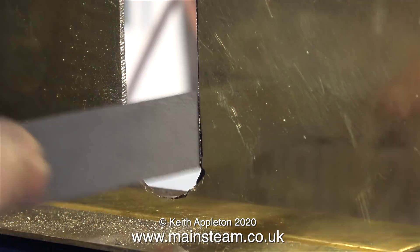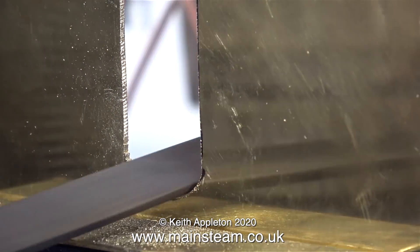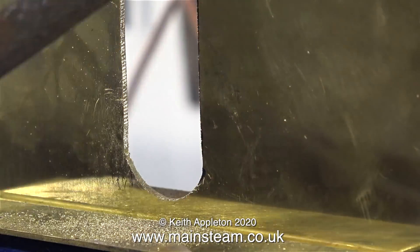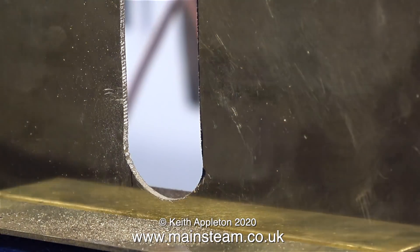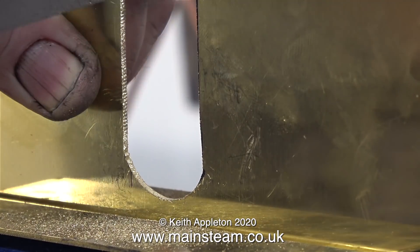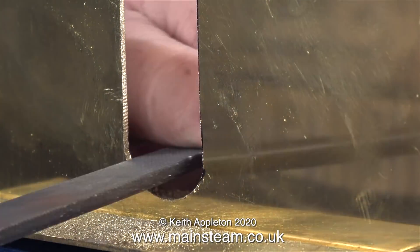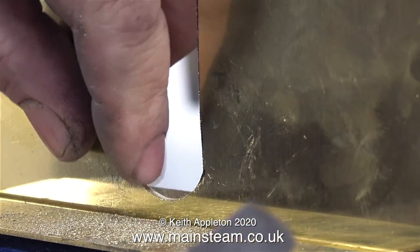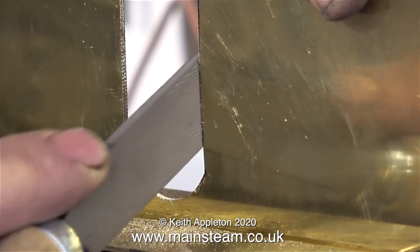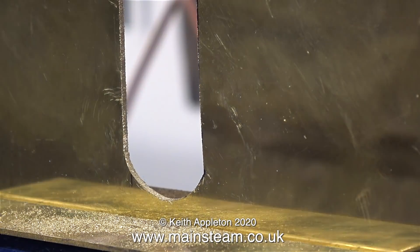There are several ways I could have arrived at this slot in the side plate. I could have removed the machine vise and the rotary table from my small milling machine, clamped this down to a piece of wood, and used a milling cutter to cut out the slot. Alternatively I could have used a hole cutter to first cut a hole in the metal plate and then cut out the rest using the band saw. Instead I used the band saw for everything — it was a much quicker way of doing it, and when I got to the round part I just kept nibbling away at it.